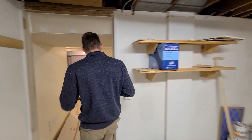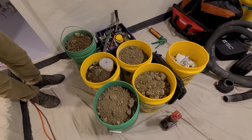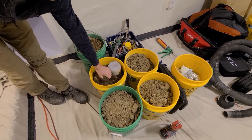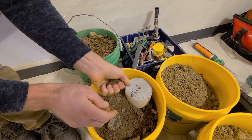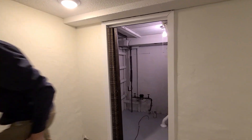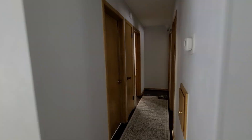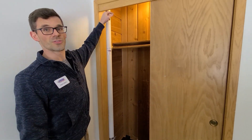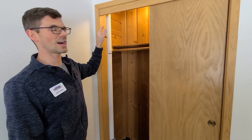On the way up we can show you the clay we took out — about 25 gallons or so. Here's the hole we cored through the concrete; it's really hard to move air through this material and some of it was even moist clay. Here's where our pipe ended up coming up through. The radon fan is directly above us and then exhausts out through the roof on the back side of the house behind the chimney.